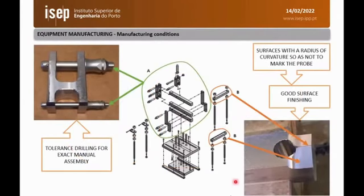The device, as I said, was manufactured in-house using a machining center. Here I am presenting part of one of the components, this link that joins the upper beam with the specimen. This is the final product showing the calibrated pins. And this is a close-up of the starting of the machining of this component. This little radius is to avoid marking of the samples, and as well, as it has a radius, allow the displacement.